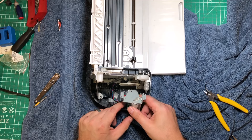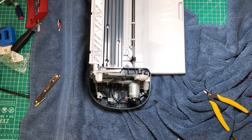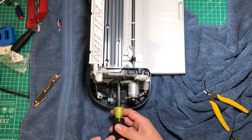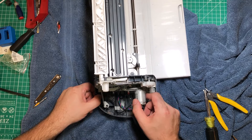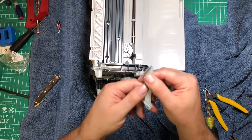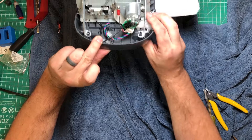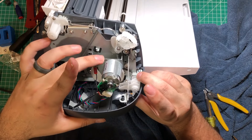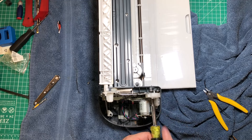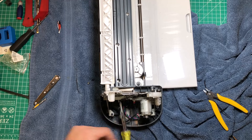Now we're going to cut our motor loose because it's time to put it back. Make sure everything meshes up properly — push this gear on all the way and make sure the bracket is in the hole. Put just a single screw in the lower left hand hole, not even super tight, as your alignment screw. Make sure the gear has meshed and everything feels like it's fitting good, not binding. Then take the bracket we took off, get it on the post, and pivot it around so it fits right over the holes that hold the motor bracket. Once you feel good about that, put one of the black screws in the upper right hand corner to hold the bracket and motor in place. Then go ahead and put all four screws in — two silver on the left, two black on the right.